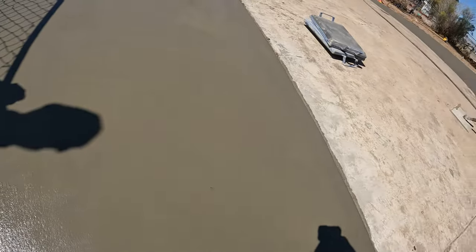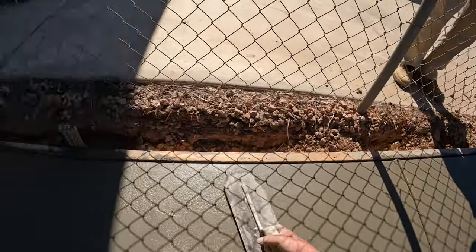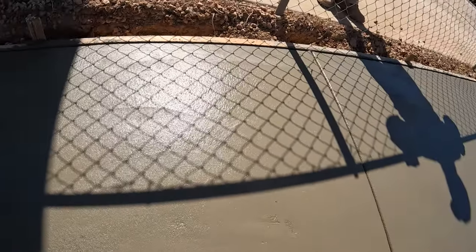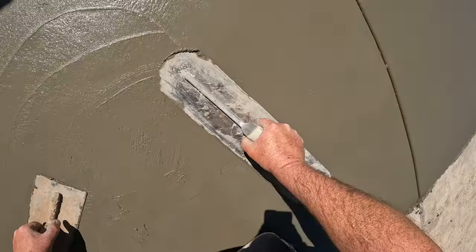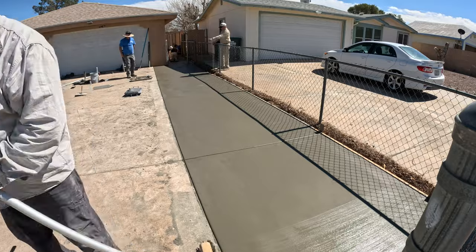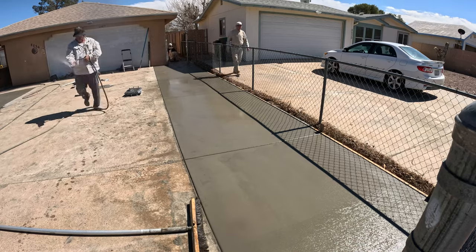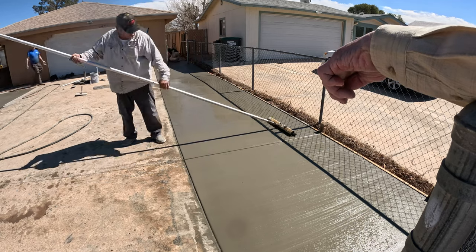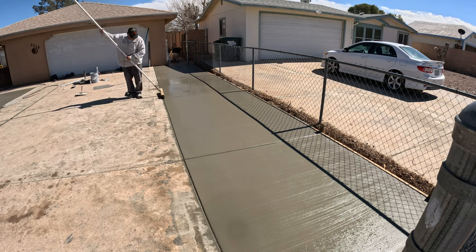The trowel I'm using here is a 20 by 5, and then I've got my little 12 by 5 — my burner. Some people like a 3 by 8 for a burner. Greg grabbed the horsehair broom and is brooming out the balance of the other side of the driveway. Tristan is on the sliders on the side yard, jointing it out every eight feet and brooming it on the way out.